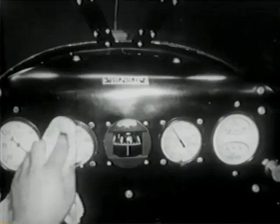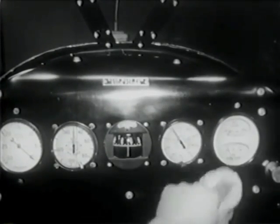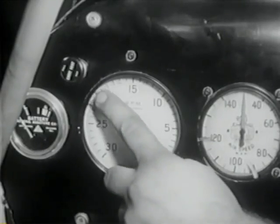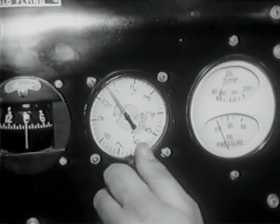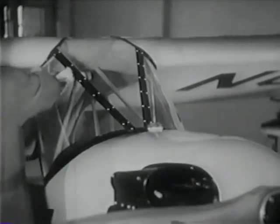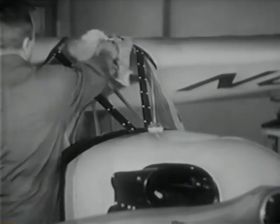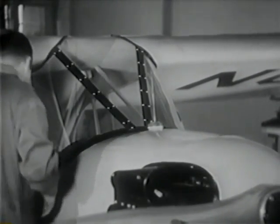While cleaning the instrument panel, see that the cover glasses are tight, no dirt is underneath, indicators are at the zero mark, and operational limit markings are plainly seen. Test the altimeter adjustment by moving the adjustment knob. Try the cabin window — see that it slides easily. Clean the cabin enclosure inside and out, finishing up with the windshield. A transparent cabin top extending back from the windshield may strip off in flight if it is loose at the leading edge — see if it's secure, and your inspection of the cabin is complete.